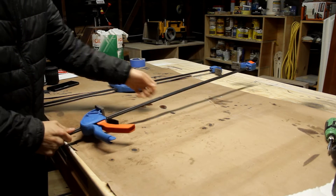This next one is great if you work in your shop by yourself like I do and you're working with larger panels. It can really be a pain to try to hold one upright while you're clamping and screwing the other one on. So what I like to do is just take any clamp — really any size would work, but I like using these 12 inch clamps here. And if you have one of those C clamps, the wooden ones where you twist to tighten, those work even better, but any clamp will do. Just use the clamp as another pair of hands. And if you don't have corner clamps, which I suggest you get some, this will help you and save you in the long run. So as you can see, I don't have to worry about holding that other piece up — it kind of just holds itself up. Look at that, it's perfect.